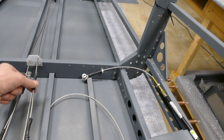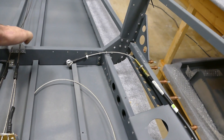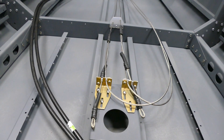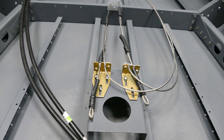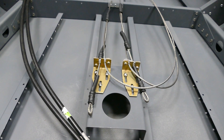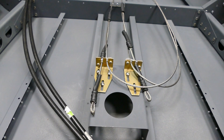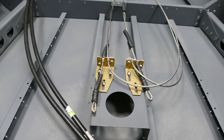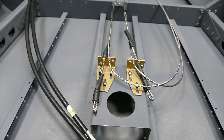This cable from the left side of the plane is the one that goes above the right cable and goes underneath the other one. There was another small problem on the rudder cables — the inner cables are higher than the outer cables. These had to be changed because the inner cables go down to the rudder pedals in the front and the outer cables go up to the fuselage and are fixed there with some springs. So you have to drill out the rivets there and change these two positions, but it was not really a big thing.